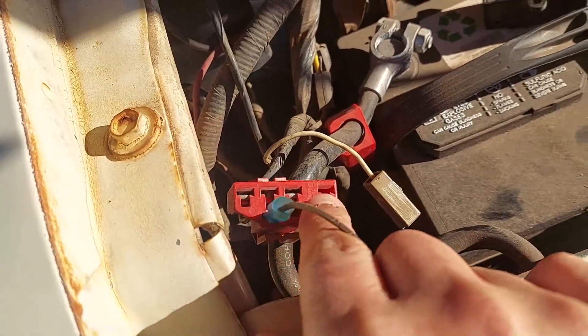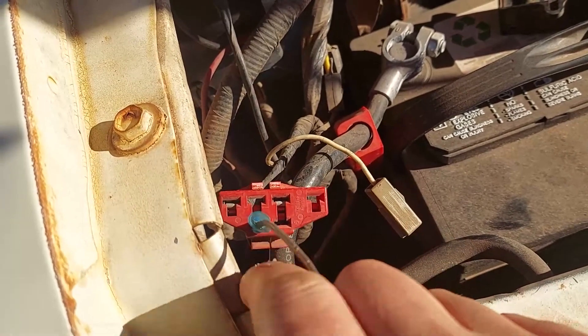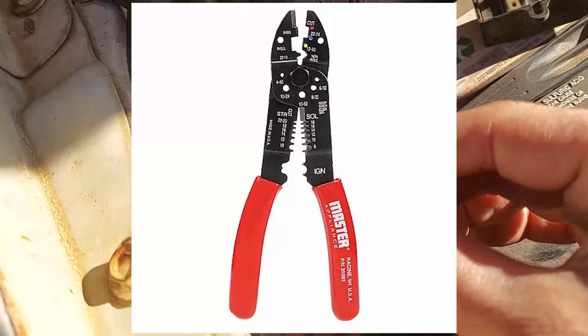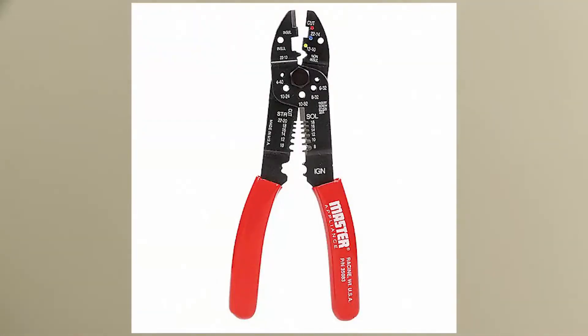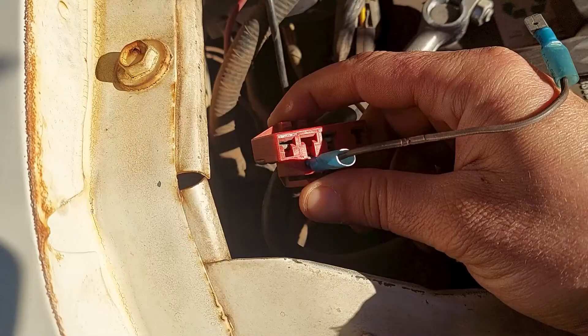It's really simple — you just find any kind of electrical cable. I just used a little speaker wire. Any kind of wire that's going to pass current. Then you're going to use a crimping tool: strip each side of the wire a little bit, put it into these male ends, and crimp it down. That's really that simple.